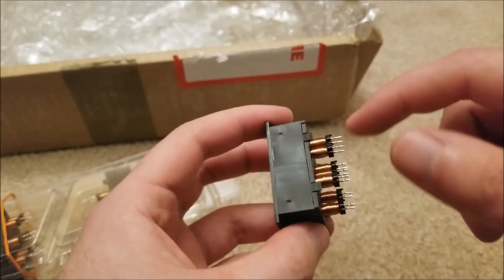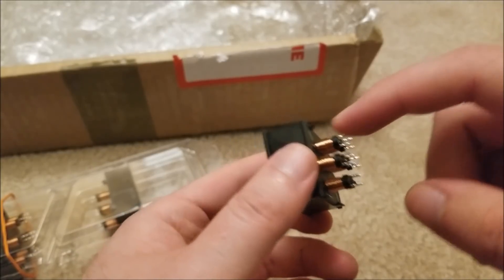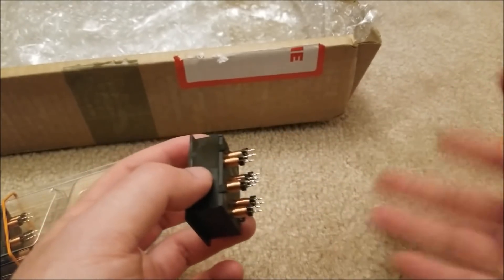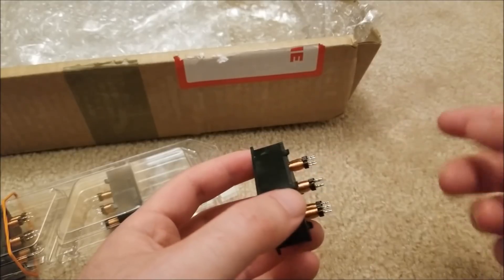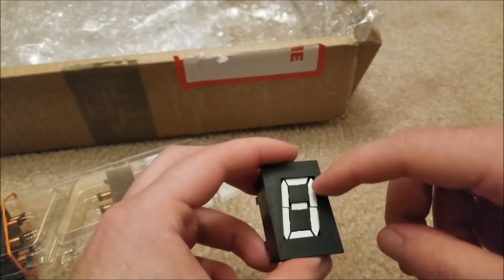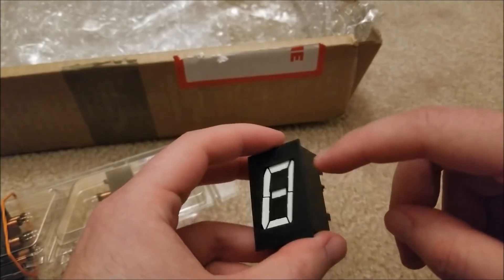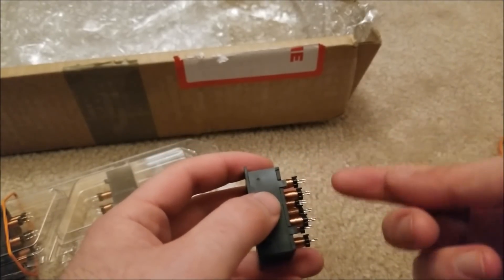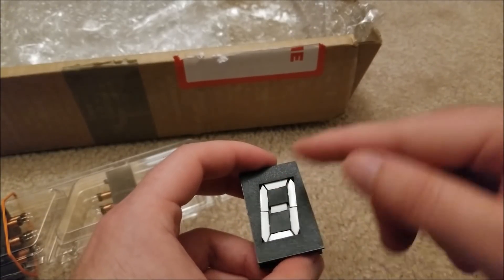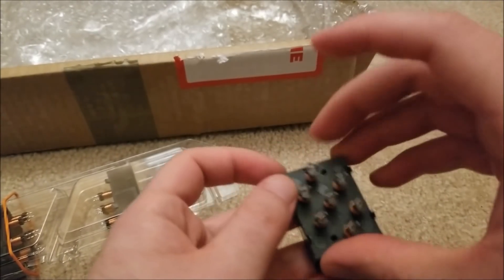You can see here on the back it's basically electromagnets, and there's a kind of magnetic core material that has remanence. What that means is if you apply a polarity — like flipping the north-south pole of a magnet — once you remove power, it remembers that polarity. On the back of each of these little segments there's a little permanent magnet, and depending on the polarity of when you last energized the electromagnet, it'll either stay open or stay closed. It basically just flips past the black bezel to not display the digit.